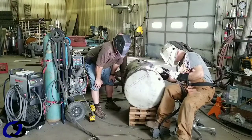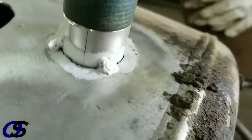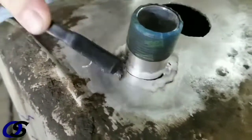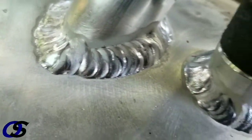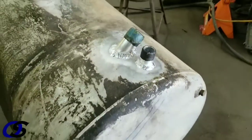So we start off at 60%, do the cleaning, wire brush it, and then go back up to 75% or 80%, whatever seems to work for the material. On this project, we turned it back up to 75% to weld. That is what I've found to clean very dirty and oxidized aluminum. That seems to work the best.